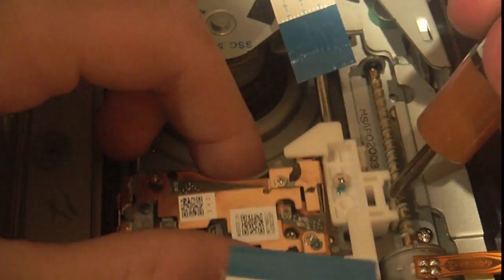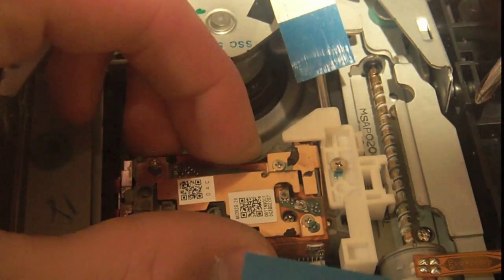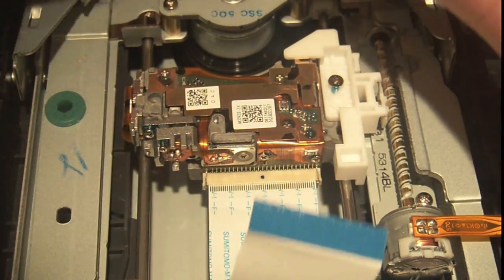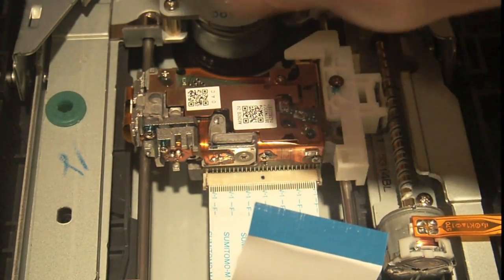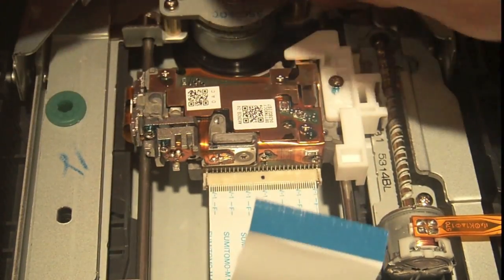You can see there's this worm-style gear motor here on this motor, and as it moves along, it just drives this along these two rails. So that's how they can get the movement of the head. The main motor is right here, so we can take that out to see. It's just going to probably be a regular DC motor. This is going to have to be a stepper or a servo of some sort to actually do anything.